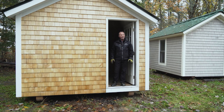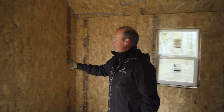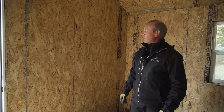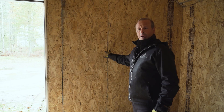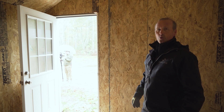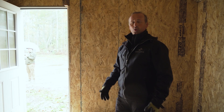Got a little bit of work left to do getting the thing level and we'll be all done. This is the interior of the 10 by 12 SIP building that we build in our one-day SIP class, and as you can see it's completely unfinished. The interior of the structural insulated panel is OSB — just behind this OSB is the foam that insulates the panel, and on the outside is another layer of OSB. Those are all glued together into a foam sandwich. The next step is to install SIP tape, which is a vapor barrier tape that goes over all of the seams so that moisture can't migrate into them, and then your interior finish can be applied — whether that's gypsum, tongue and groove boards, or just paint if it's a storage shed. The nice thing about this building even though it's quite small is that it's nicely insulated — the floor, walls, and roof are all insulated. The SIP floor is actually the structure of the floor, spanning between the runners that the building is dragged on.